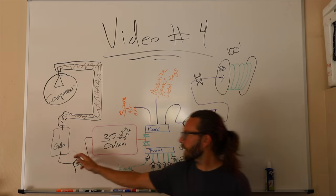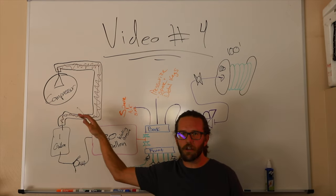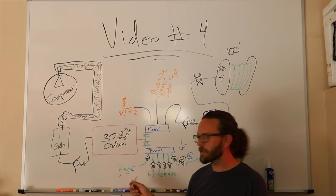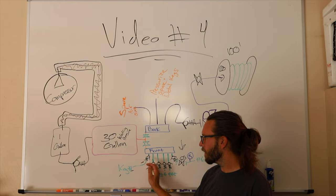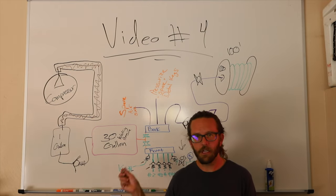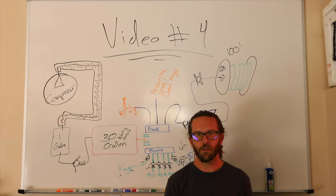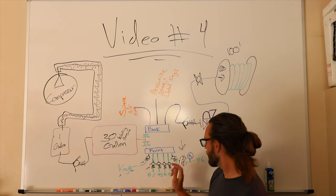So I can go and I can empty anything back here, anything. I can have a leak, whatever. These kegs are still full, ready to go, because that pressure's been locked right here. Okay? Super convenient. Check valves cost a couple bucks. To have that actually in working order when you need it, like when time is of the essence, oh my gosh, more than happy you have it.